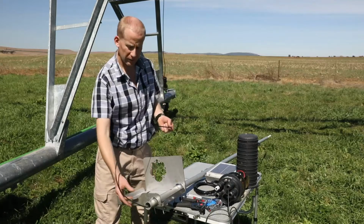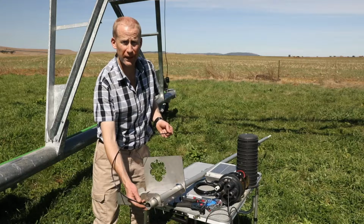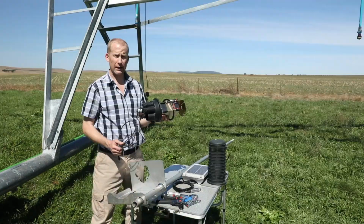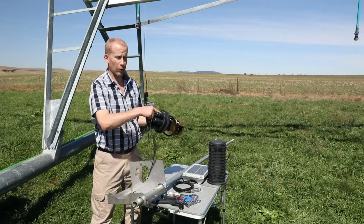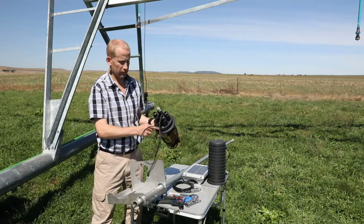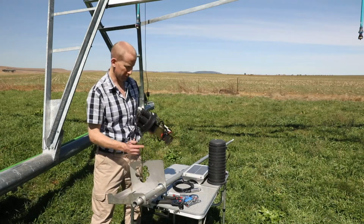The RF cable is now sticking through the bottom of the antenna pole, and you need to be extremely careful not to damage the cable. Next, we install the enclosure onto the pivot bracket. On the bottom of the enclosure there are threaded inserts, and we use M6 bolts to secure it onto the bracket.